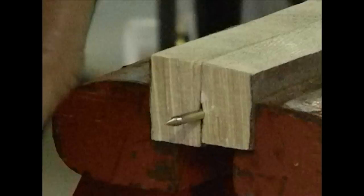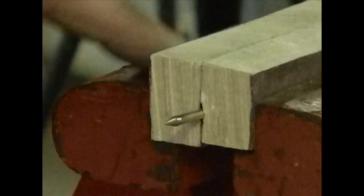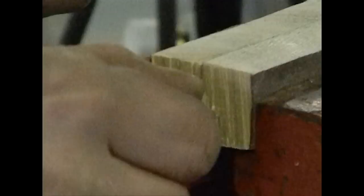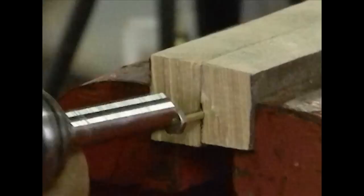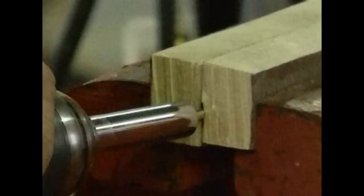I don't know how well you can see the thread starting, but once you get to a certain point, the rod is going to want to spin inside the wood, especially if you have it vertically. If you take your rod and put it horizontally in your vise, it gives more of a gripping surface for the vise to grab onto and will hopefully stop the spinning. So I'm going to use a deep well socket and try to finish cutting threads on this.